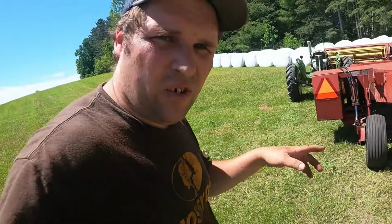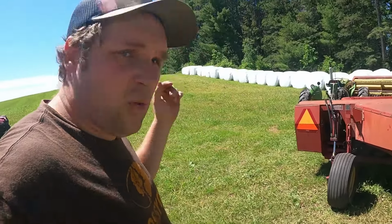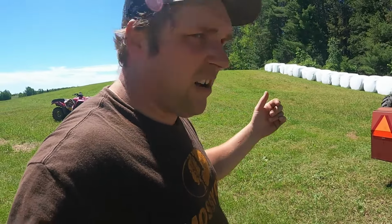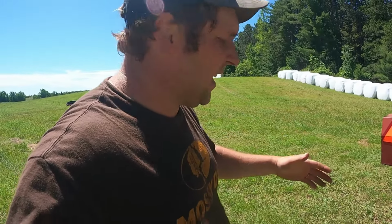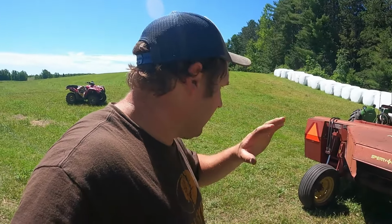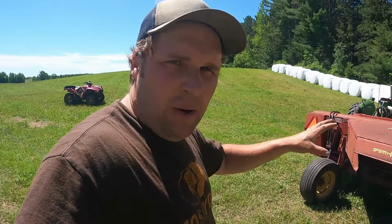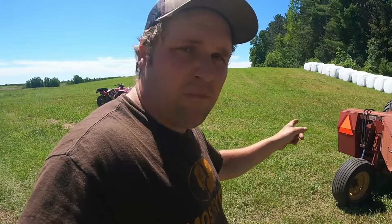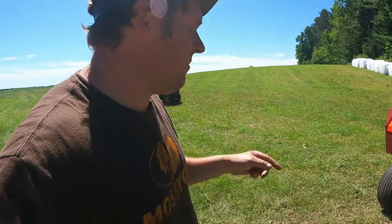All right, so I took it out. Jordan went up on the hill. He was gonna get some video of me coming up, but I didn't even get that far. I went maybe 20, 30 feet. As soon as I set it down, I was in a real heavy spot of hay, and it jammed up right away. It stopped the reel and stopped the sickle. I think that belt that was loose, I need to tighten it more.